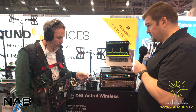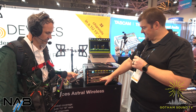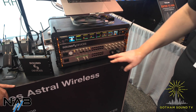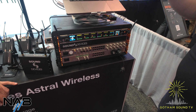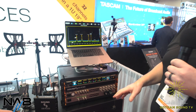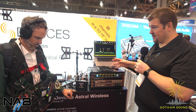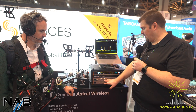Does the Super Nexus support Dante redundancy? It does. On the Super Nexus there are four network ports and they're all going to be individually assignable. You can assign your control network; you can have a merged control and Dante network like on the Nexus, or a separate Dante and control. At launch it's just going to have Dante, but in a future update we're planning to have a Dante primary and Dante secondary function, which is individually assignable per network port, so you can choose RJ45 or fiber if you need a fiber network connection.